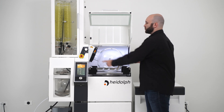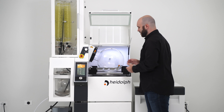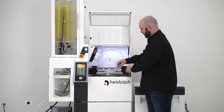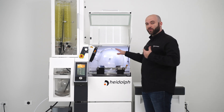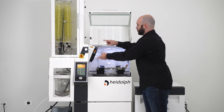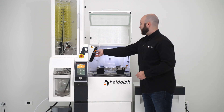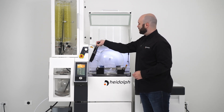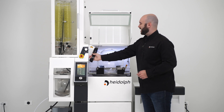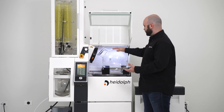The way it works is we would first lock the flask so we don't get any rotation. Then we have these two support bars here that can be closed to support the weight of the flask. And instead of having a clamping system that you have to unscrew multiple times, we wanted one that was much more simple. To operate that, we push a button in, lift up, and pull down. That will disengage the clamp and we can slide it out using those bars.